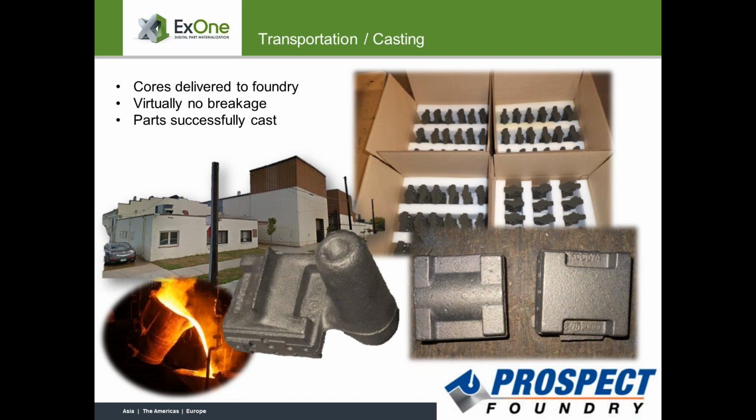Absolutely. This particular core, as small in diameter as the passages are, is about as fragile as you can get. You've got big, heavy core prints on the end, and then you have all these 1/4 inch, or actually slightly below 1/4 inch passages running through this thing. They're very susceptible to cracking and breaking. And the packaging that you send them in is fantastic. We very seldom see a cracked or broken core.